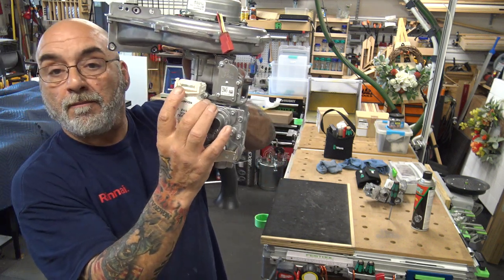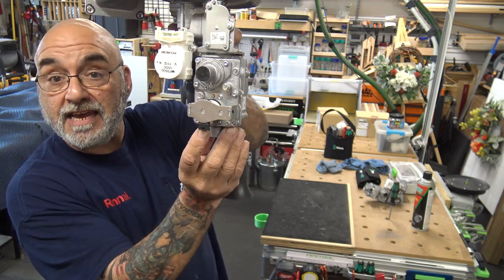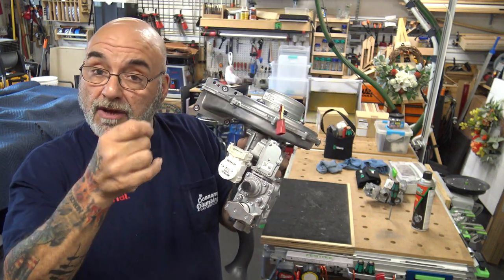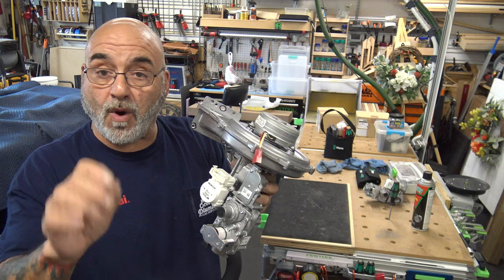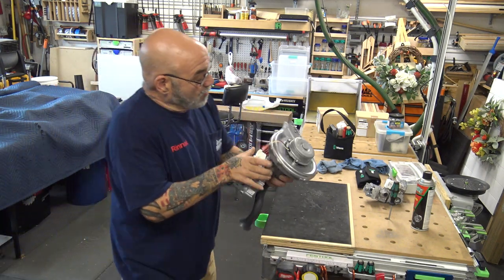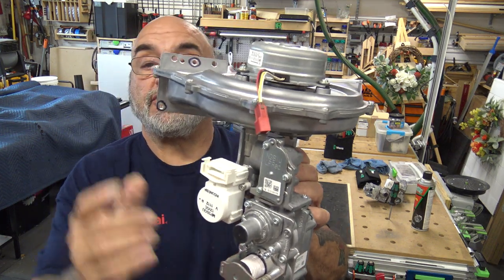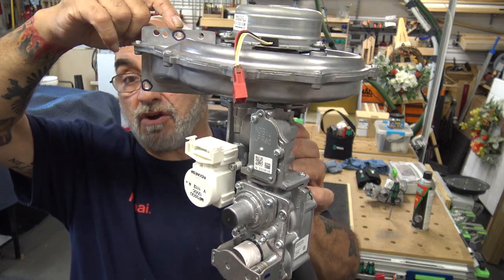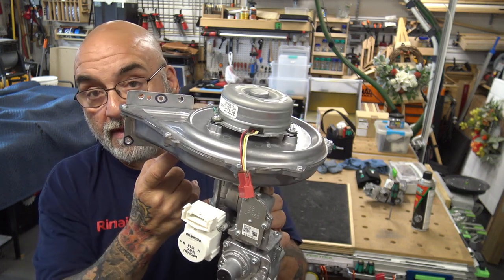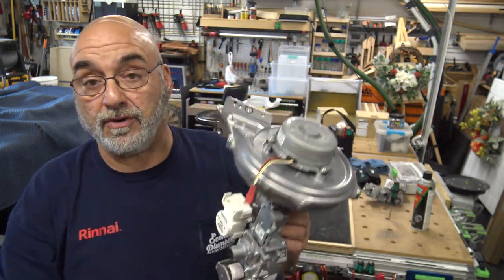Then you have the wire here that is powering the motor, and then you have the wire here that's powering the gas valve. And again, those are the little push and pull down. And again, these wires only go back into their mated part. All right. Then I circled, you're going to have to remove those 3 screws, the black circles. That one, and that one. That will now remove this fan from the actual unit.